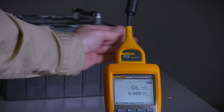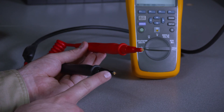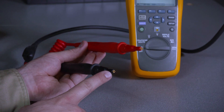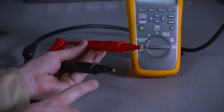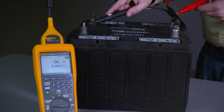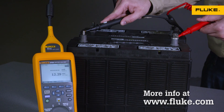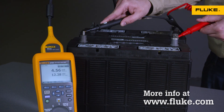This is the BTL 10 probe, a simple two-prong probe with a Kelvin connection. The insulated center pin carries current while the outer pin measures voltage. Voltage drop caused by the test current draw is zeroed out by the Kelvin connection, nullifying its effects. Check out Fluke.com for more information.